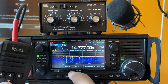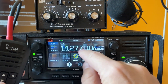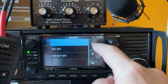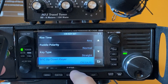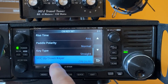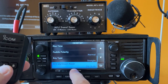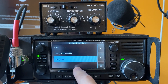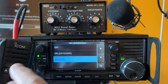So we go into CW, and in there in the menu, go to Keyer, and in the Keyer, select Edit Set. In there, we go into CW Key Set, and on page two of two, you have the Mic Up/Down Keyer, which enables the buttons on the mic to be used as a keyer. We can select two choices: either the Up and Down, or the A/B buttons.